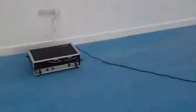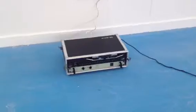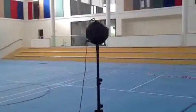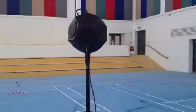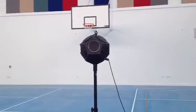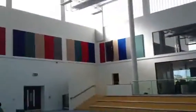Here we have an amplifier unit and receiver as well as a third octave graphic equaliser. This is our DODEC speaker that we use as a noise source. The amplifier generates pink noise, and this speaker is used as a source to generate the pink noise within the space so that we can carry out a reverberation test.